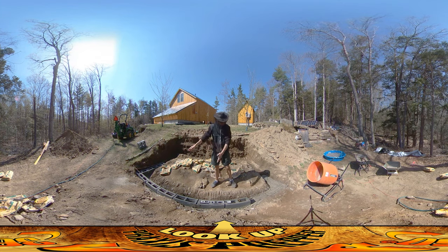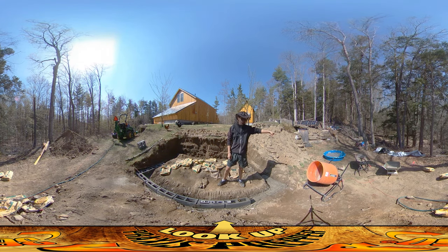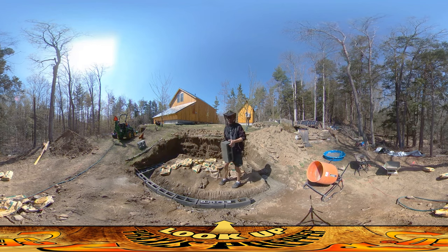The work that I'm doing right now is putting in this cinder block wall for the chicken coop. I made a footing the other day which goes down several feet, and then what I did this morning was put down a bed of concrete and now I'm sticking the cinder blocks down into that. I've got the cinder blocks over here in this pool, and the reason I got them in the pool is because that helps to soak up water, so when I put them in they are nice and moist on the bottom and I'll get the best adhesion to the concrete.